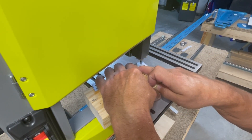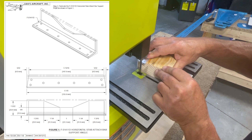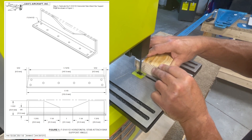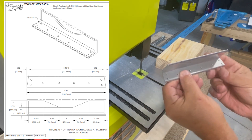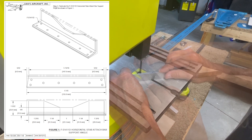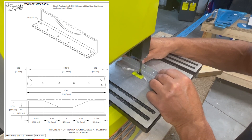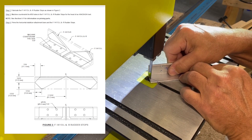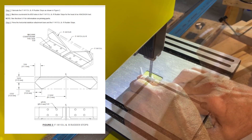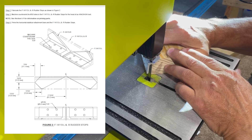A couple of parts require a good bit of fabrication. The first one is the horizontal stabilizer attach bar support angle - it comes as just a rectangular piece of aluminum angle, but as you can see from the diagram it needs a bit of modification. Looking at it from the top down view the sides need to be trimmed, and then from the front view I need to take some measurements to cut out this angle. The other part also starts as a single piece of angle which needs multiple detailed cuts to produce two identical rudder stops. It's important to really take your time to fully study the views before marking and cutting to end up with the right result.